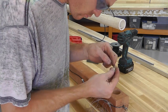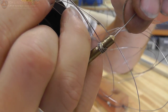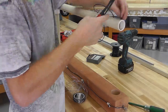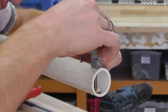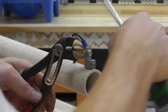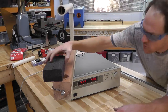It's 100 foot. So here I'm inserting it into the little brass bar that I just cut. And wrapped it around there, and that's how I'm holding the wire in, the top and the bottom. So I went ahead here and set the bottom in there, measured the top, cut the wire, wrapped the top. And I'm using an electrical connector here as my top bar. So here I'm using a U-shaped connector and attaching the wire there and tightening it down. Again, that little connector is another electrical piece that you can find at your hardware store. I'll get a better close-up later.